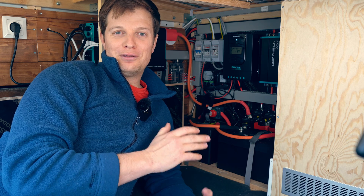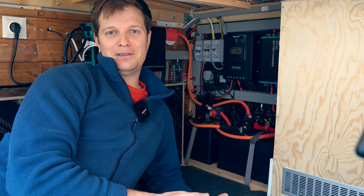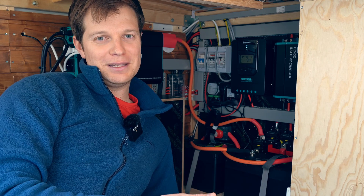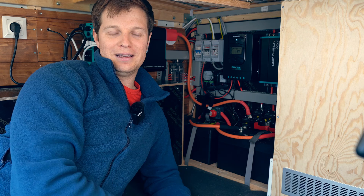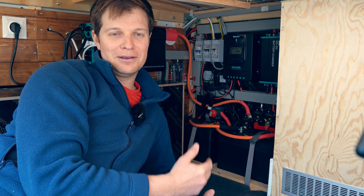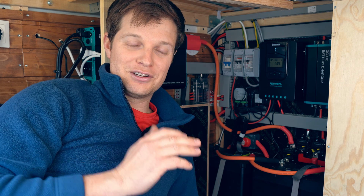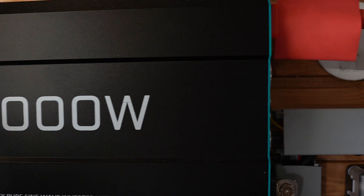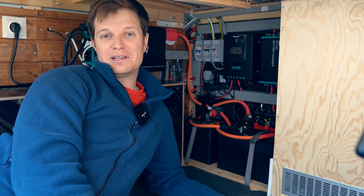You're probably wondering why we didn't go for a 2,000 watt inverter and charger all in one. It was simply the weight and size. The inverter and charger are really small and lightweight. It did cost a little bit extra, but I would rather that than have a big 20 kilo unit. Our inverter weighs about two kilos and the charger is not even a kilo. It has all the same functions — auto switchover and all the protections — it just doesn't have the charger built in. The inverter cables are 70 mil, running through its own 200 amp DC circuit breaker.